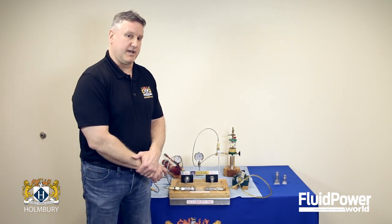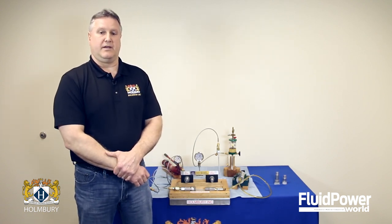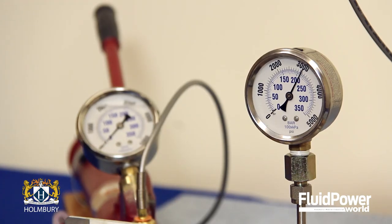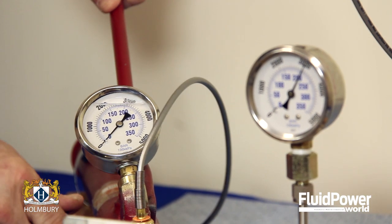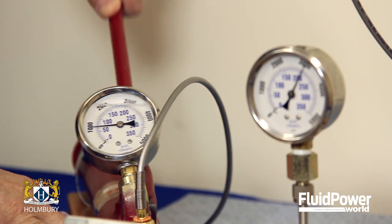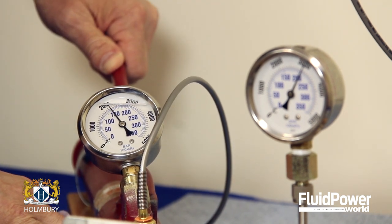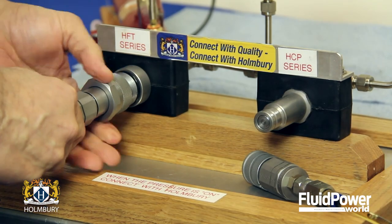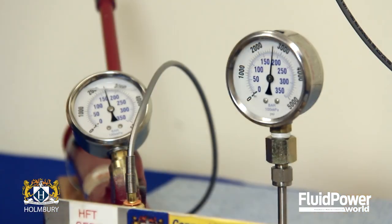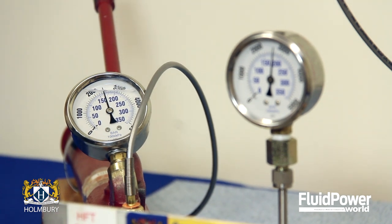In this demonstration, the first hand pump again acts as the source, raising the pressure of the trapped fluid to 3,000 psi. The second hand pump simulates trap pressure on the machine side, in this case 2,000 psi. Two different pressures are used purposely so you can see when the connection of the two couplings is made, as the pressure in both gauges will read the higher pressure.